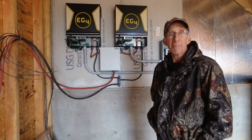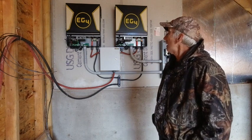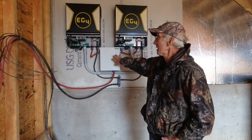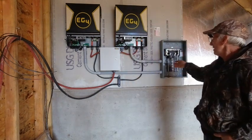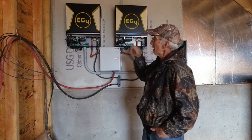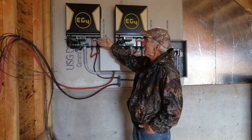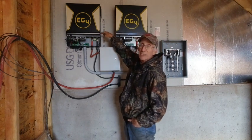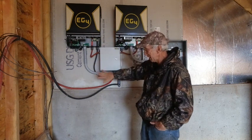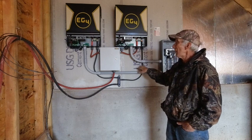Good morning. It's a bit chilly here in Arkansas, but not too bad — at least I'm inside out of the wind. I've already started on setting some of my control equipment, the EG4 controllers. Also behind me is the electrical panel that will service the building. With the EG4 converters all-in-one, there's really no reason to mount them low. They say to mount them at eye height, but there's nothing user-serviceable from here up. So I mounted the EG4s high, which also allowed me to run a solid PVC conduit into the side of the service panel.